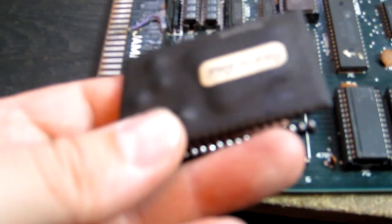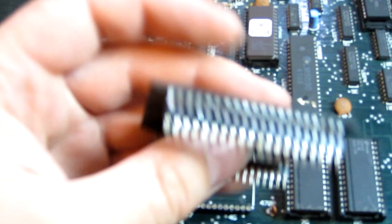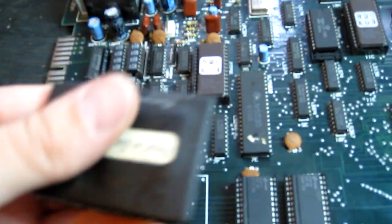I've removed the Konami custom from here, which contains an RGB pack, and it's got two RAMs on the back. This is the one I've just removed that seems to have a missing green, and this is one from another board. It had a few weak legs on it — well, a couple of broken ones actually. So what I've done is soldered all the pins into some SIL header row pins, so that should strengthen it and be fairly reliable. I'm just going to put that in and give it a test.